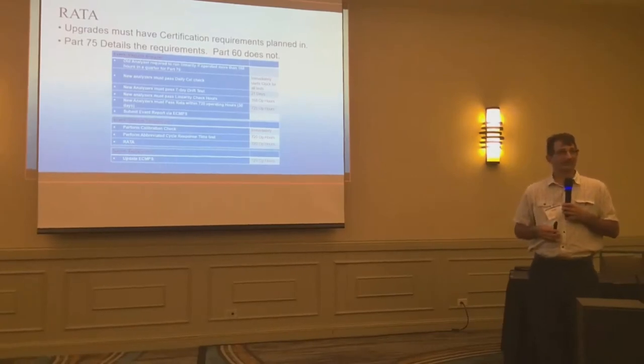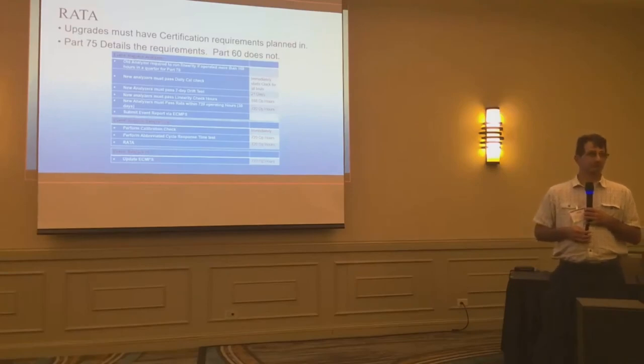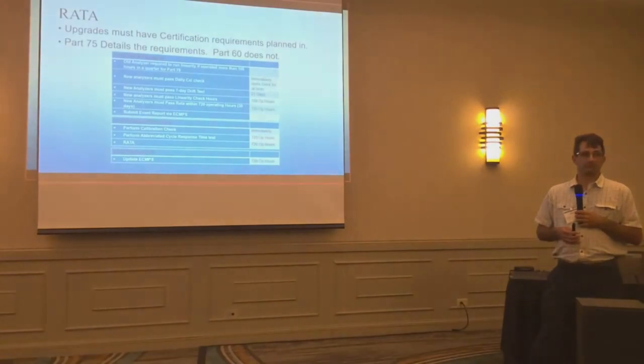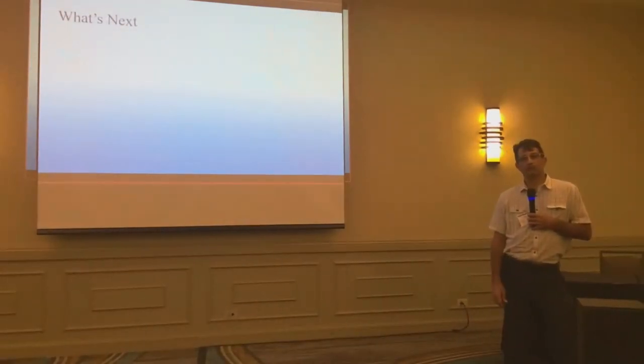Or not. It sounds funny, but just before you replace that old analyzer, it's a good idea to run a daily cal. Because you want to make sure that data is QA'd up to the point you replace it. Otherwise, it may only be 8 to 24 hours, but you may lose some data based on the QA requirements. We've learned the little nuances that don't seem like much add up after a while. So let's run a cal on the system before we tear it apart. That sounds funny, but that's exactly what we're going to do.